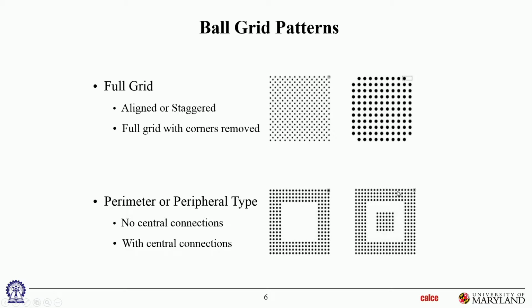And let me define the architecture a little bit. We're talking about an organic laminate, much like the one you're carrying around. Okay? So it's a die mounted on an organic substrate. And let us say it's a face-up die with wire bond on the backside of this component. Sorry, it's actually a flip chip because it's an area array here too. So it's a flip chip and underfilled.